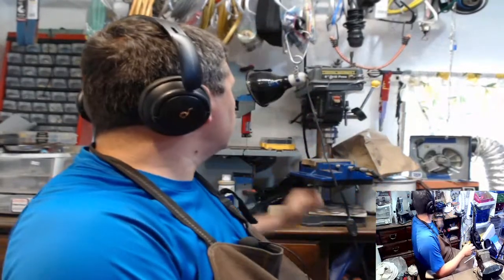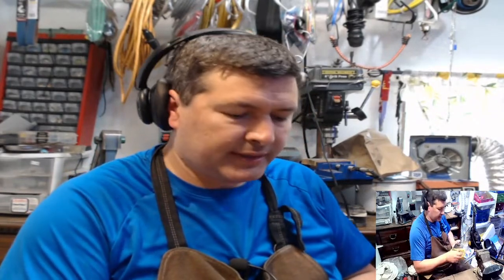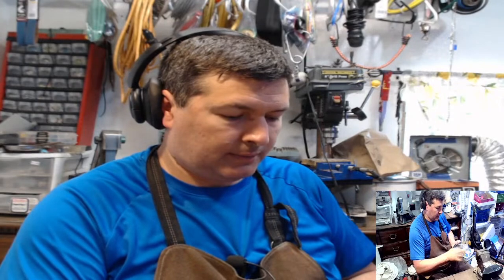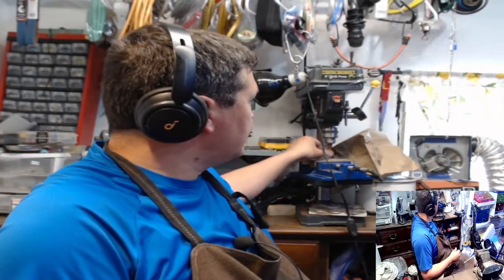So we did it. That's the last of my special orders before we leave. The size drill bit is tiny, a 3/32 bit. I like to use the cobalt bits, but this time I didn't have them. I just have the high speed one for this. The cobalt bits are a lot stronger. They'll cut through most stainless steel, and so they'll last a lot longer on the silverware. And with a little bit of wax, they cut through.